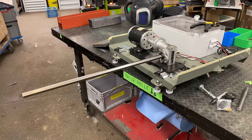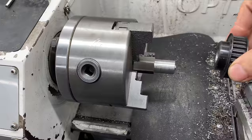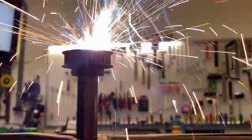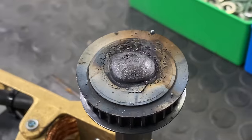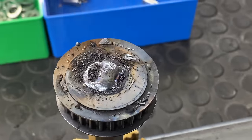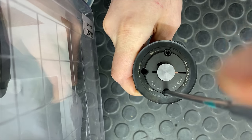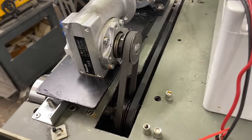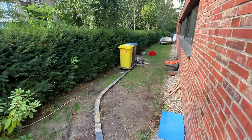I'm using one of these rubber hoses to connect the gearbox to the motor because it's flexible, so they don't have to be aligned perfectly. I made the shaft a little bit narrower to fit these belt gears, welded them on at first, but then discovered I can also buy them as taper locks — which are much better because they mount perfectly concentrically, screw down really tightly, and grip the shaft well even without a keyway.